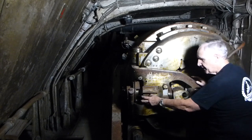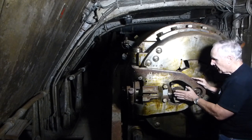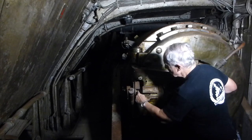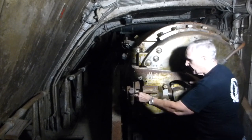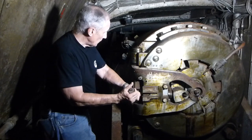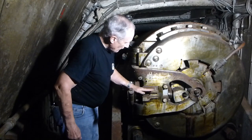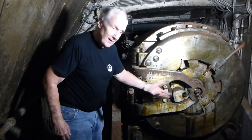There's a bracket here that acts as a guide. To operate the lock, there was an operating bar that fit in there and attached to what was called the wedge on the lock. There's also a set of cams — this is called the lever cam — and there was a pin on the end of the operating bar that worked so that when the breech was closed all the way and then swung up, not only did the plug rotate the lock into place, but the cam forced the operating bar to the side, and that's what closed the firing lock and made it ready to fire.